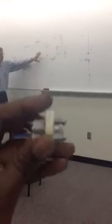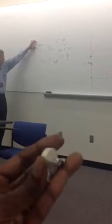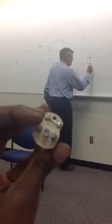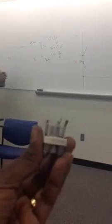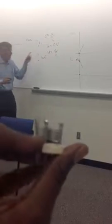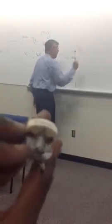Okay, since the voltage went up, that means there's now less voltage across the resistor. So that less voltage, less than 10 volts over 1K, will give me less current. But I still have current, so I'm still putting charge on there, but now I'm putting it on at a lower rate because my current is not as high. So since I'm not putting it on as rapidly as before, the rate of change of that voltage is going to decrease.